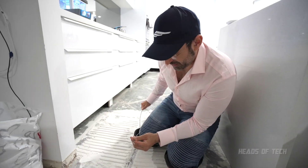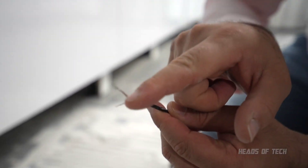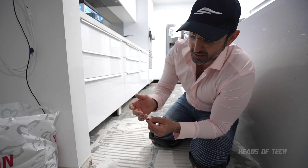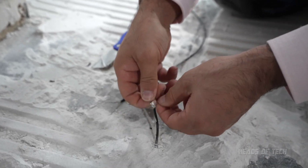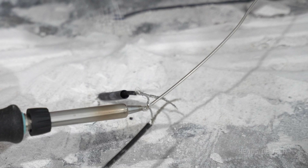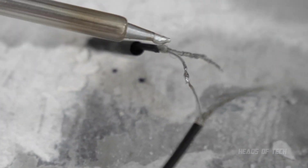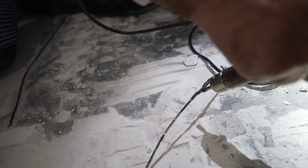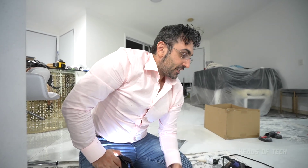Now in the real world, I have an actual problem wire to fix in the other room. I've ripped through a cable heating strip. If you peel it back, it consists of two elements: the shielded one, which is the heating strip itself, and the shielding used to connect the earth — so if there's any arcing, electricity flows back to earth. I'm separating the shielding from the actual wire, then heating the wire and feeding solder onto it from the top. Giving it a few seconds to warm up — a nice bit of solder all the way around. To finish, I'm dabbing a little silicone over it to make it watertight.